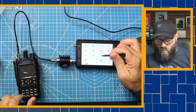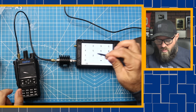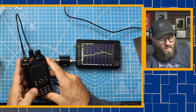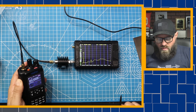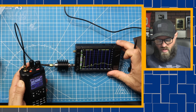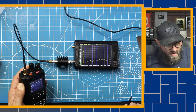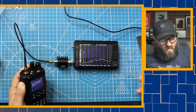Going into measure, harmonic, 223.500 MHz. Making sure the level is at negative 40 times one. My goodness - it looks better on 220 than it does on two meters, and it's supposed to be a two-meter radio. It's not even advertised on Amazon as a 220 radio. Look at that: 223.500 is showing zero for the fundamental, no second harmonic at all, and the third harmonic is right at negative 40. This is a better 220 radio than it is a two-meter radio. I was not expecting that.